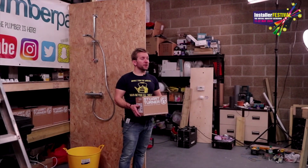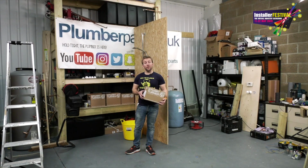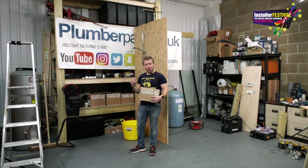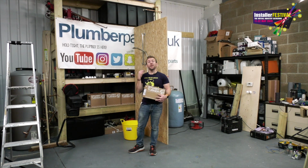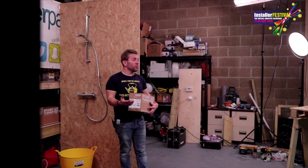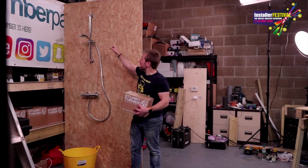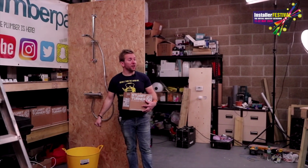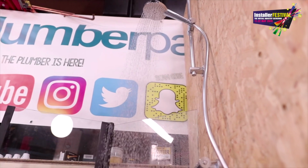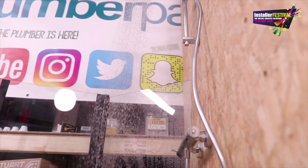Exactly how one of these Stuart Turner pumps works, how they can make the flow from your shower much better, but also why you should install certain types of pump. So we've got the universal, the negative head pump and the positive head pump. The positive head pump is the one that relies most on the head pressure delivered by the tank above us. That's why sometimes if I go to someone's house and they say, I've installed a brand new shower pump and it doesn't work, take the head off, sometimes hold it into the bath or the bottom of the shower, and lo and behold, the shower pump cuts in because it's got that flow over the micro switch and then it starts working okay. So really impressed with these.